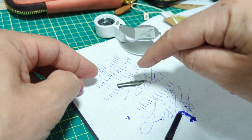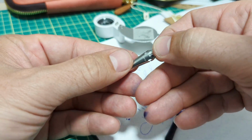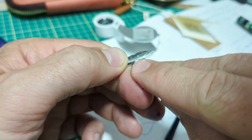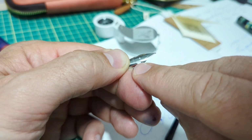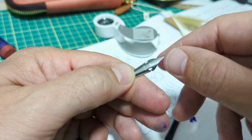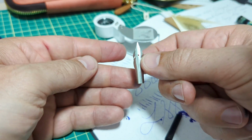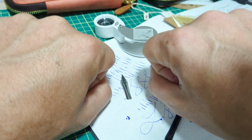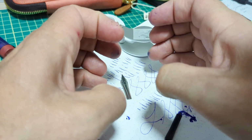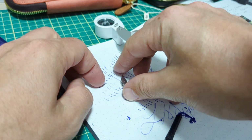Now the process of forming this creates internal stresses in there. That happens in any manufacturing process, okay? But as you can see here, we have some cutouts. So there's sort of a weak point here compared to other spots around there. Now, when you put in the slits, that gives the nib a chance to move, because all the internal stresses are introduced, but they're forced to stay in that one position. You cut the slit, they can do this, they can do this, they can do whatever they need to do, right?